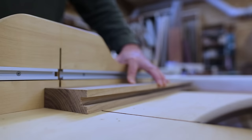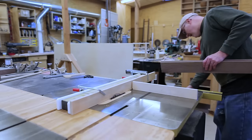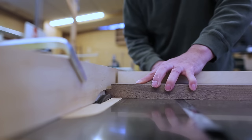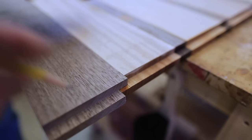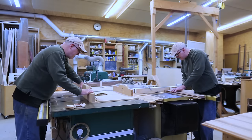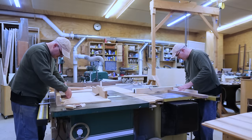Then I cut the shorter pieces to very close to the right length and set up the rabbets on the ends. Once I had a piece in place, I marked exactly how long it needed to be — leaving it just a little bit long so the panel would float in the groove. I set it up to use one saw to cut the length and another to cut the rabbets, and this worked pretty well.